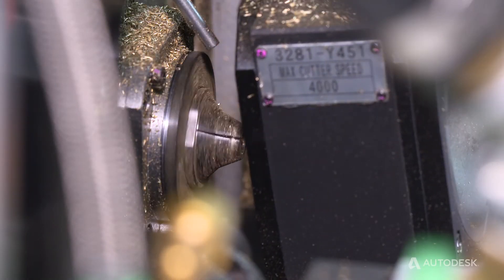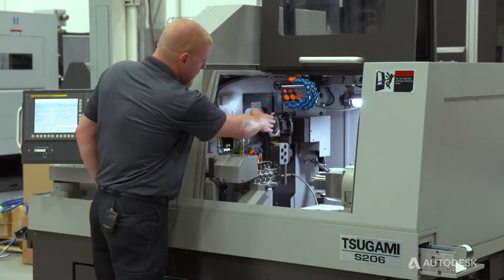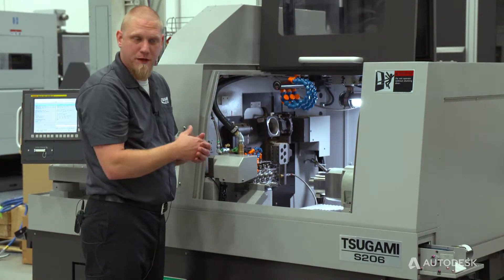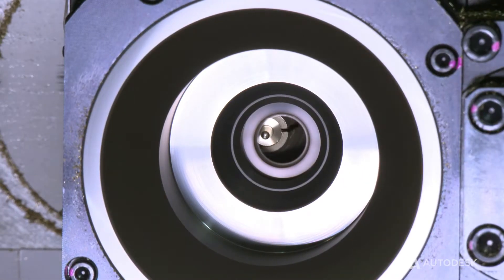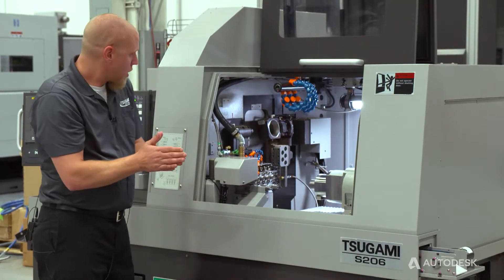This whirling unit moves for your helix angle for your thread pitch. What you do is rotate it to the helix angle that you calculate by figuring out the pitch diameter. The gang slide is going to come down — you're basically doing an external mill feature when you're doing the whirling. So when it comes to setting that angle, are you doing that visually and then checking the part and readjusting? Or what's the process there?